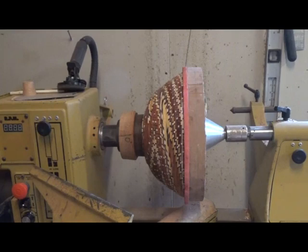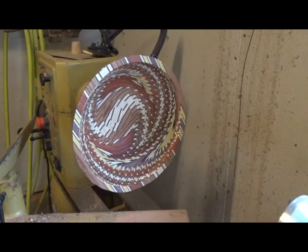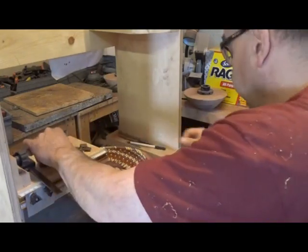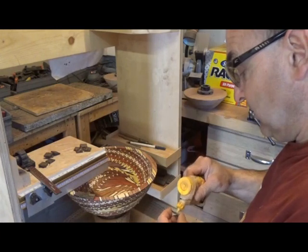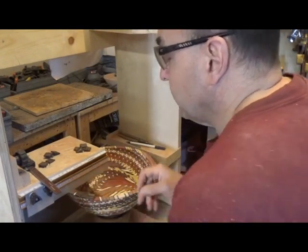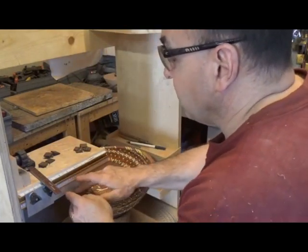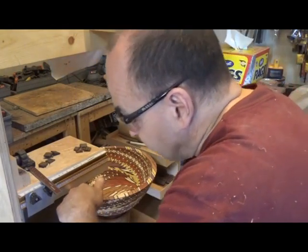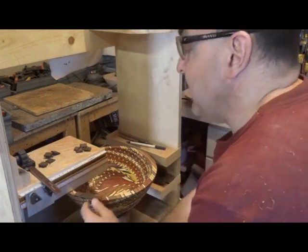I've got all the rings cut out and put in. I'm still going to put a trim on the top to match the bottom wenge. I've got to let it dry now for a bit, then put the top on, and then I can start lathing. All the rows are on now. I will put the trim wenge on the top as a trim piece, and then we'll be done. This is actually my open segment jig, but I use it for both open and closed now. Putting 48 segments around the ring here for a trim piece. I had this wood cut for a different open segment project, so just using it for the top. It's already been cut up and made, so it's pretty easy.